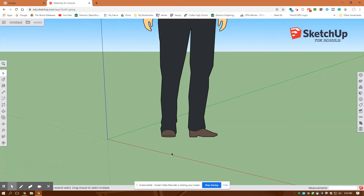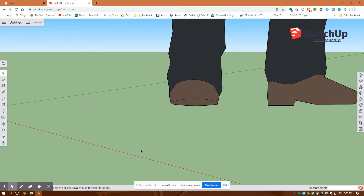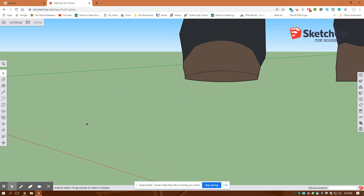It's a Lego brick, so compared to the default figure it's a teeny little thing. I'm going to zoom way in and start by creating a rectangle. I'll click in the lower left corner, drawing in Y and X, and enter the measurements 32 comma 16. Since I selected a millimeter template, I don't have to include the units. Then I'll extrude up in the Z plane — I grab the surface, it turns polka dotted, draw it up eight millimeters and hit enter.